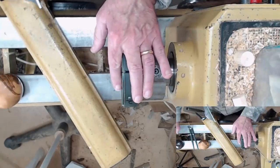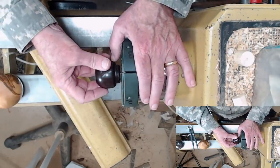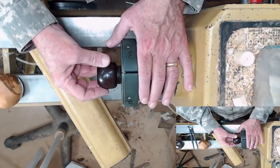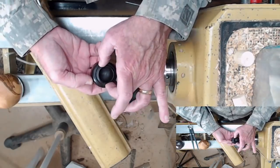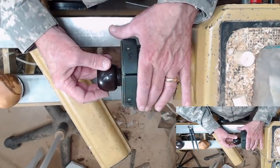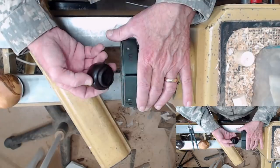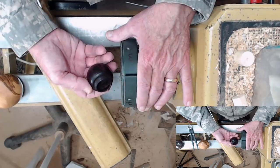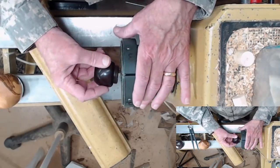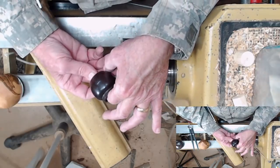Now, what I would also like to do, but it's cutting it pretty close to the screws, is have a smaller one on the inside, about 30 millimeter across, about half as big as that one, that's cut deeper, and it will just barely clear the screws. So I'm going to do the big one first, and then maybe I can come back and make a smaller one and cut it with a 16 thread per inch for small boxes that I make out of exotic wood, 2 inches.